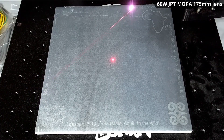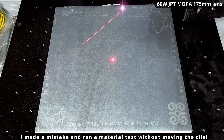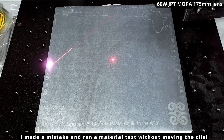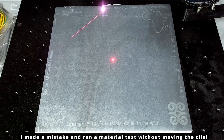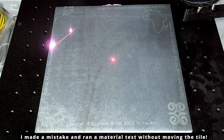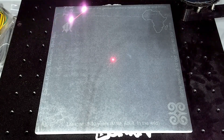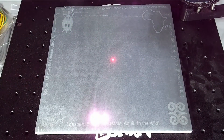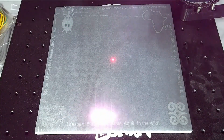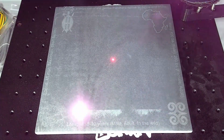During testing, I found that the light color I wanted for the text and graphics just didn't come out right on its own. But through multiple tests — burning up a bunch of tiles in the process — I came up with the idea of changing the speed, power, and frequency and running back over something that's already been etched, like a template. I did wind up changing that, and now moving on to the image layer.